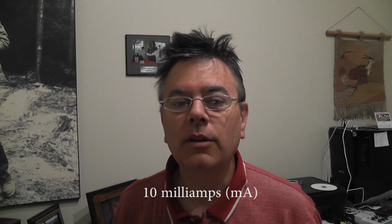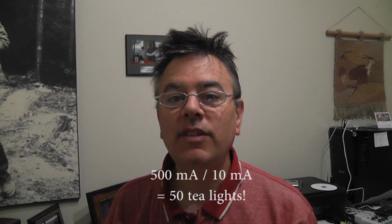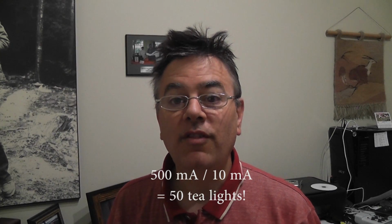I actually used my multimeter and measured the current that one of these things draws. Believe it or not, it changes on the fly, because the light flickers. It goes to different brightnesses, and the different brightnesses draw a different amount of current. However, at its brightest, it draws about 10 milliamps. Why is that important? Well, if you look at an adapter like the one we bought, it's capable of producing 500 milliamps. So a little quick math: 500 milliamps divided by 10 milliamps equals 50. That adapter will run 50 tea lights. That's quite a few, so you probably don't even want to run that many off one because you have wires all over the place. But it gives you some idea of how little juice these things draw, which is why they can run on a battery for so long.